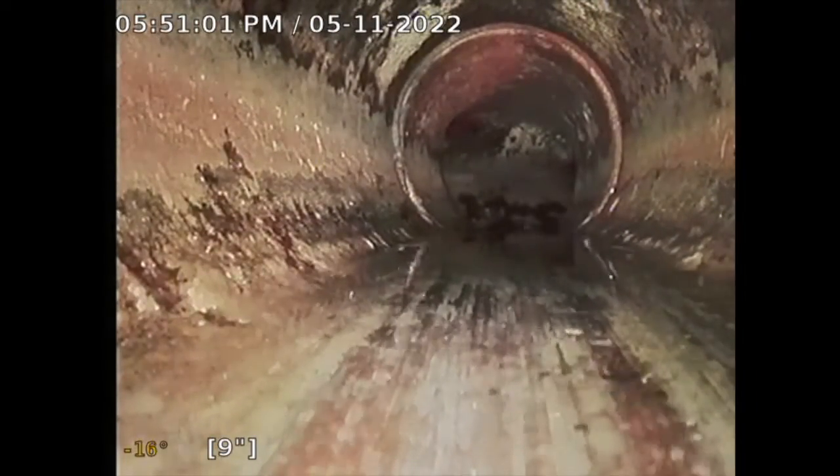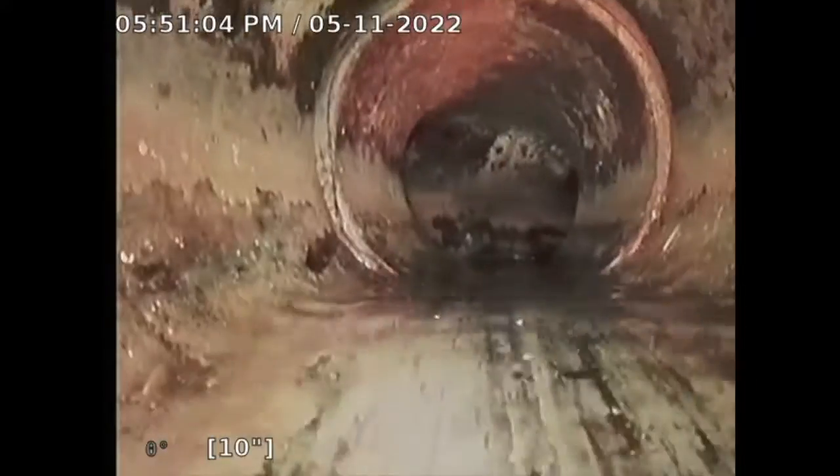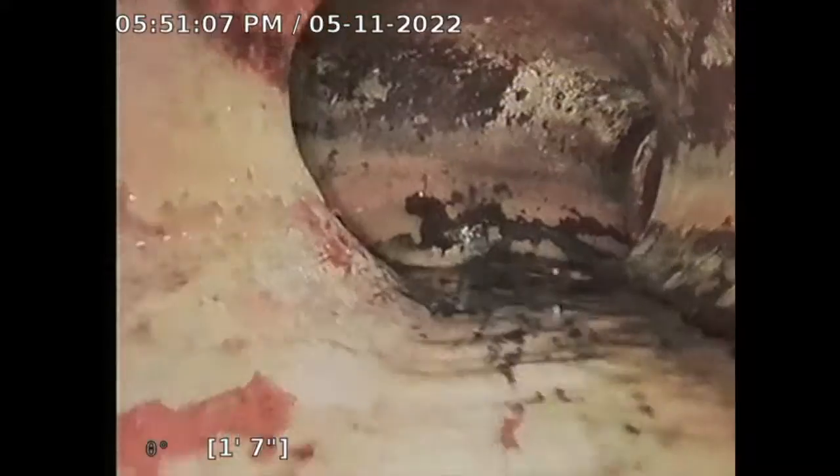The property faces north and the sewer line should be headed towards the north side of the property, towards the front of the street. The master bathroom water and sink are turned on. The clean-out is a 4-inch ABS, and I think right away it turns into clay here.